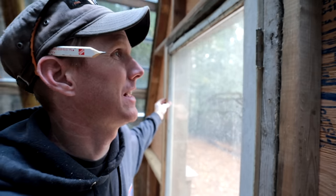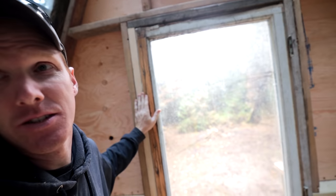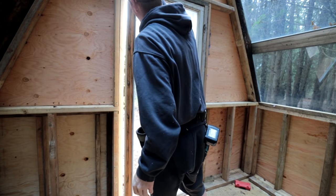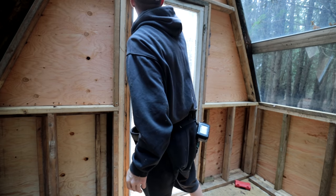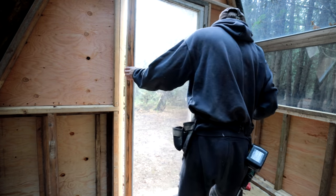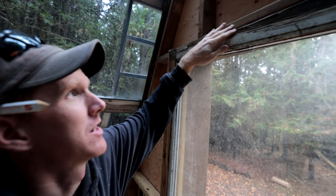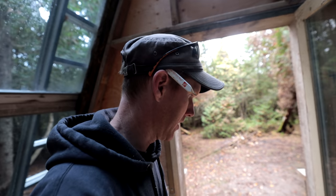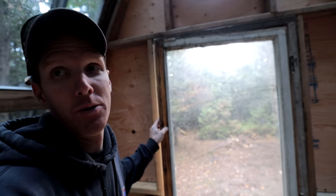Because the hinge is square and my router bit is round, I use an X-Acto knife to trim the corners. This one worked out really well — the opening is nice and square and the hinge fits great. There's a little bit of damage to repair at the top, probably from when the door was removed — I'll just rip that chunk out, splice in a piece of wood, and Bondo is your friend on these type of projects. The door opens and closes really nicely.